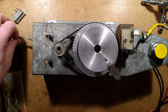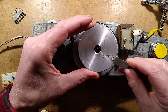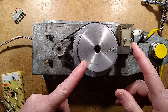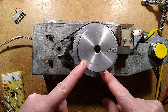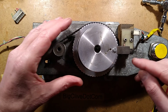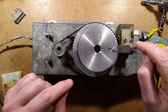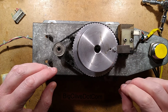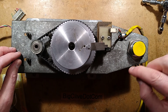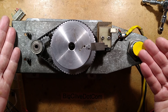The unit has three cables. This cable, which is quite thick, is the optical sensor. What actually happens is that when it slows down it detects that flag and starts counting the pulses. It works out a fairly large number of pulses, and by counting those pulses it can determine where it is on the wheel. It resets every time this flag passes - the flag is just at the start of the first side of the white segment. So if it counts and within that count it sees the ball pass over the inductive sensor, it then rotates for one more revolution.